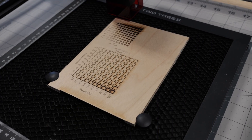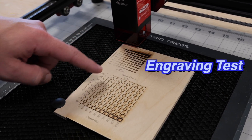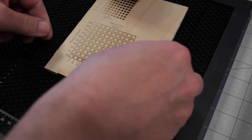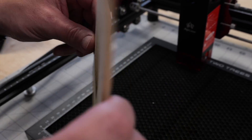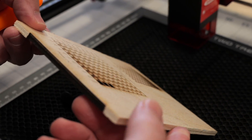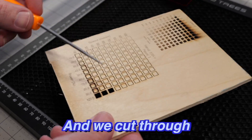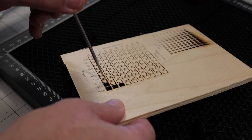Alright, we're done with our engraving test and cutting test. Let's see if we've actually cut through here — I think we have on some of them. Yeah, this is quarter-inch ply, or five millimeters, and we cut through a few of them on three passes.